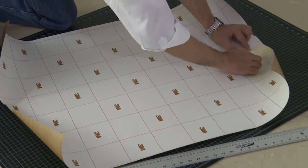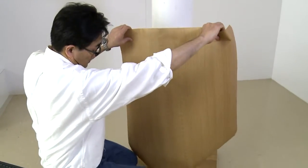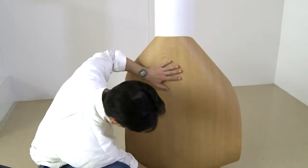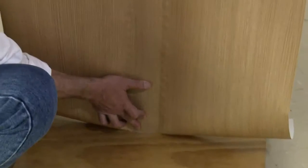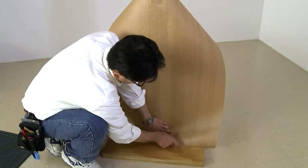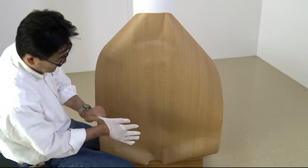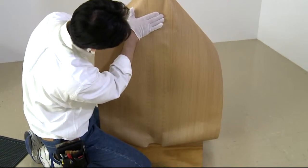Roll back a few inches of the center piece of liner and crease with your finger. Position the film on the column so the edge of the bottom notch is aligned horizontally with the base of the column and the film is in good vertical alignment. Notice that the film on each side of the notch flares out onto the floor. Although not seen in this video, you will also align the edge of the notch with the top of the column.